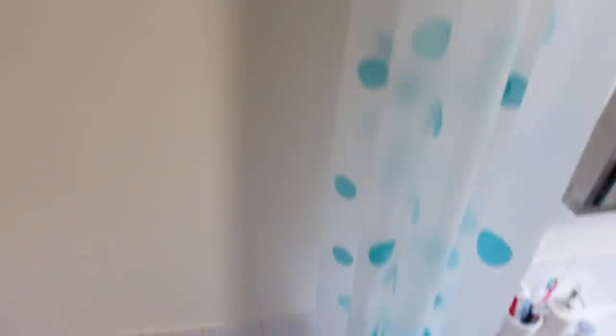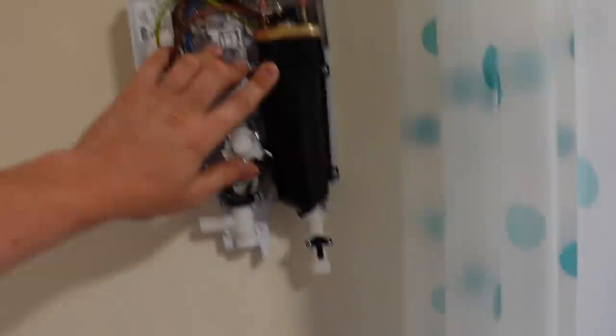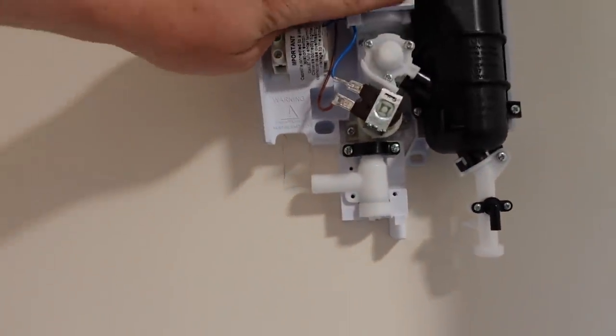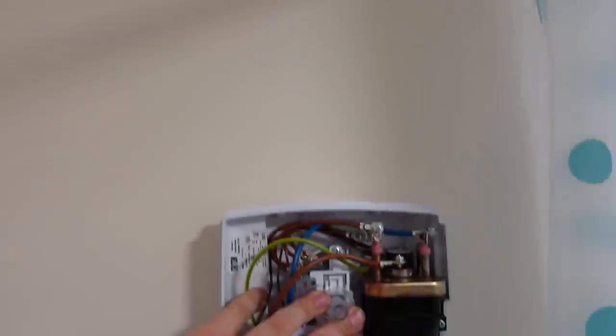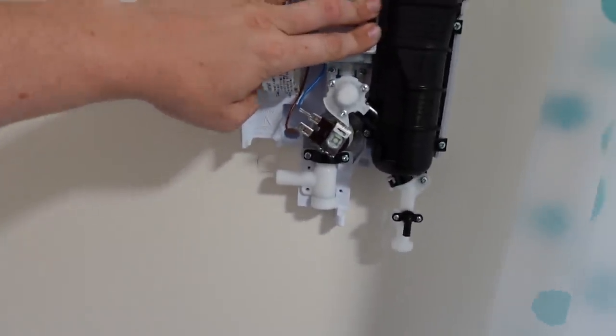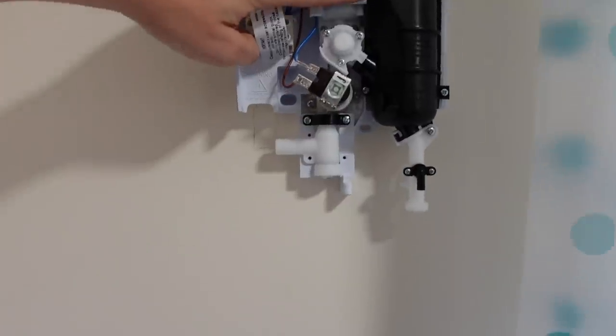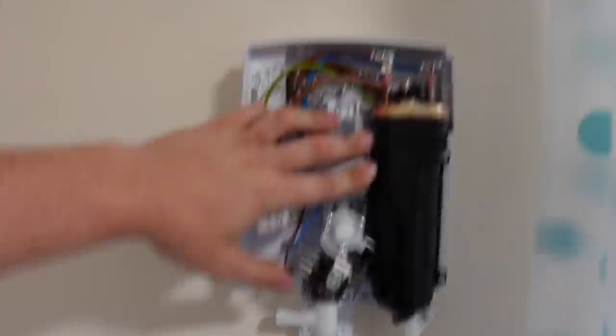What we're doing here - there's a shower screen going to be going in, so we want to make sure we're on the edge of the bath. I've done it to my chest height. Done a little pencil mark there and I'm going to get a level mark out of the top. As much as I like to record myself doing this, he's busy and I don't have a cameraman yet. So we'll knock that out, see how far we can get up with a rod, measure that out, chop that out, get a rod into the loft, and hopefully meet up with Adam.